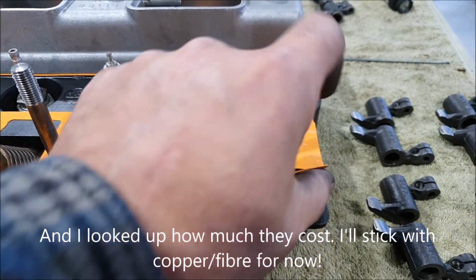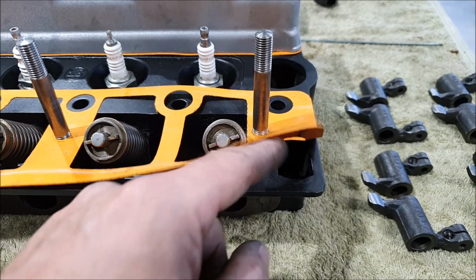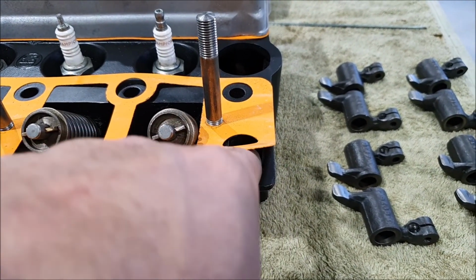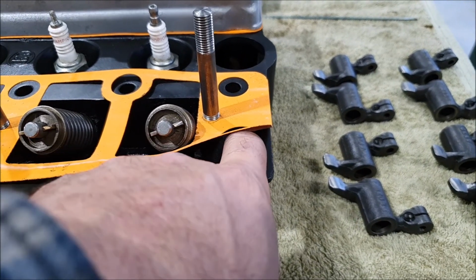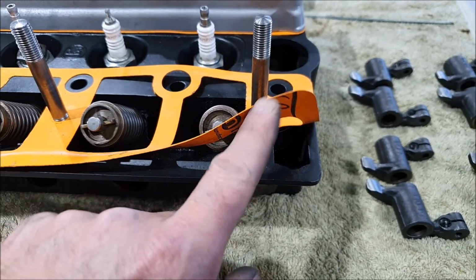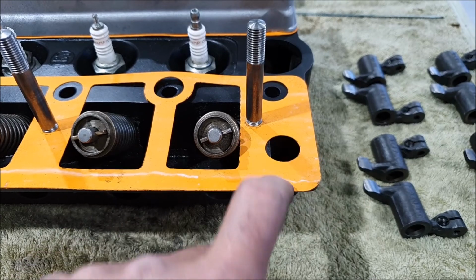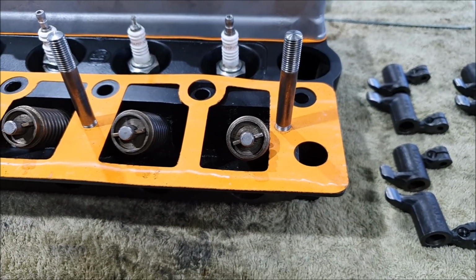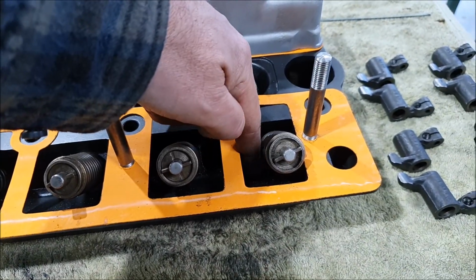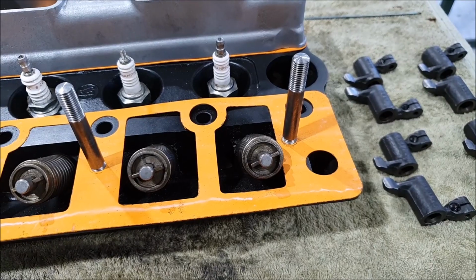It's a bit hard to see, but I don't want to pull the gasket off, I don't want to ruin the holes in it. But effectively what I ended up doing was drilling on an angle following the casting into the boss there. I just put a 1/4 inch hole through. I relieved just a little bit of the edge here so that I could get the drill bit down flat on that 45, and that seems to have worked fine. I was able to test it by basically pouring oil in here and making sure oil did drip out of that hole, which it does.